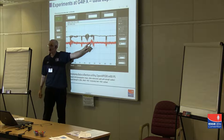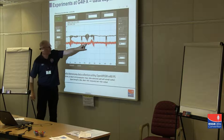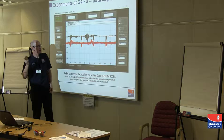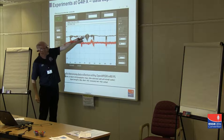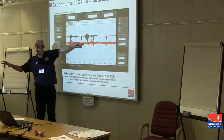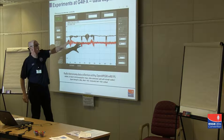So it must just have been at the right angle, so that the reflection of the vertical component was nulled out. The other thing it told me is that the difference between my two antennas was relatively small as well. The leakage, to be correct about it, was relatively small. In other words, if part of this signal was the horizontally polarized signal leaking through, my vertical antenna being sensitive to the horizontal component, you'd see that effect on that trace as well, and you don't on this particular one. Most of the time you do, obviously; this is just luck. I happened to hit that.